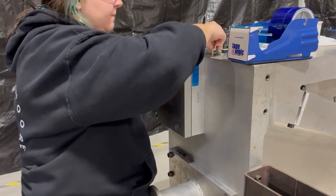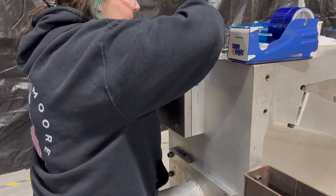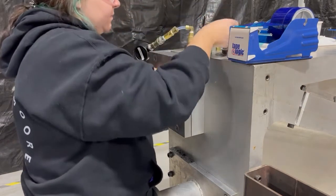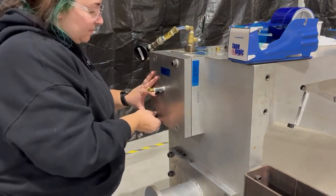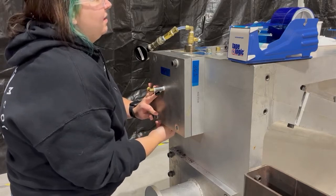The pressurization plates allow us to create a reverse autoclave effect in an oven. We are able to apply pressure to the vacuum bag during and after resin infusion to ensure we eliminate voids and fully compact the laminate.